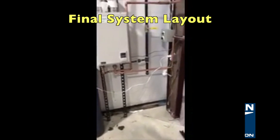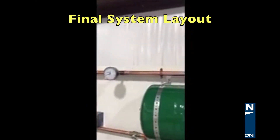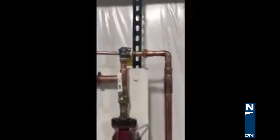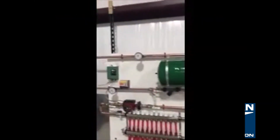There were four leaks in the system where the manifolds were connected together with the connecting nipples, because the nipples were 1-inch NPT threads and the manifolds are 1-inch BSP threads — we could never get it to seal. We welded it with stainless steel piping, so it's not going to be an issue anymore. Here's the final layout after the final pressure test. There's the air eliminator installed in the 1-inch return line, the pressure regulator draining into an overflow bucket to catch any antifreeze if we ever get excess pressure.